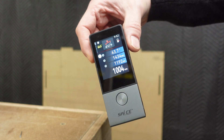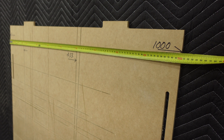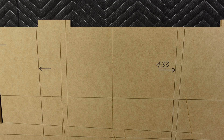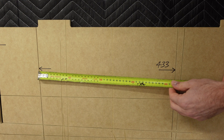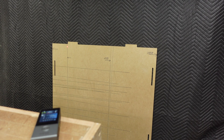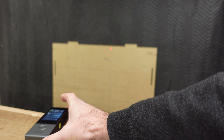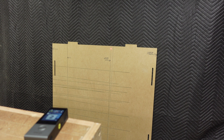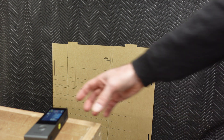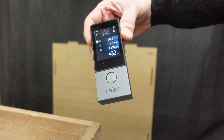If I try to measure the width of this off-cut piece of MDF, it's hard to know if I'm aiming right on the edge or a couple of millimetres in from the side. The measurement is likely to be different each time by a few millimetres. The distance measured by the tape is a thousand millimetres, and I wouldn't rely on this laser for that kind of measurement. However, if I measure the distance between these two saw cuts, the measurement is very close or exactly correct — because I can aim the laser at a more defined point, the middle of the saw cut. I'm also resting the laser on the workbench and using the self-timer to keep the device completely still. So point to point is accurate as long as I can keep the device still and aim correctly.